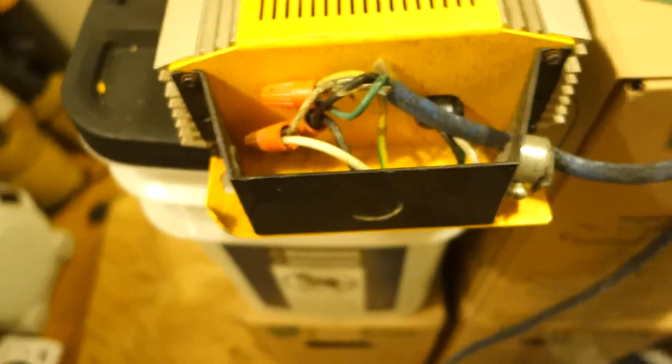Now, here's the real trick. The power cord comes out of the charger with a strain relief on it, and unless you remove that, the case isn't going to budge. So you've got to grab that strain relief with an ordinary pair of pliers. You grab it top and bottom, squeeze it fairly hard, and just start wiggling it out. Once that strain relief is out of its hole, just remove it from the wires. You're going to put it back afterwards.